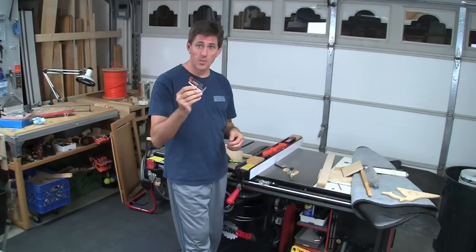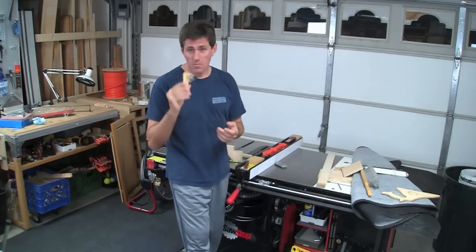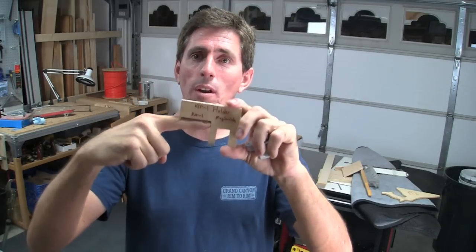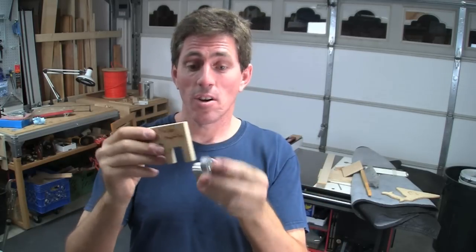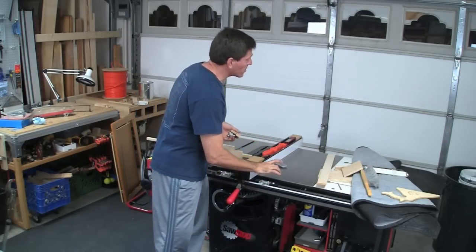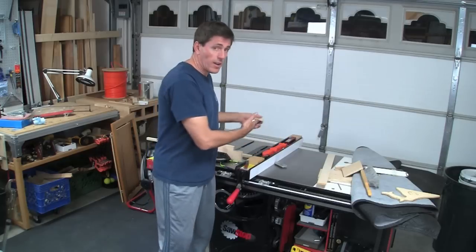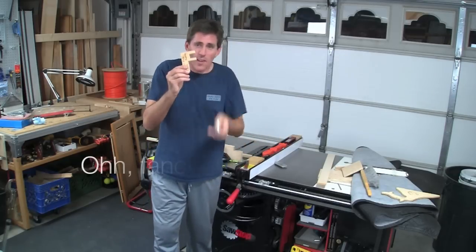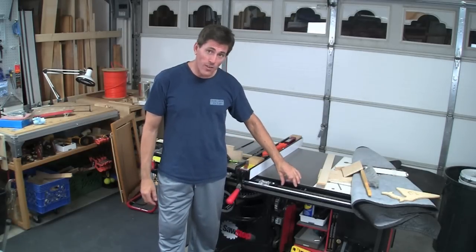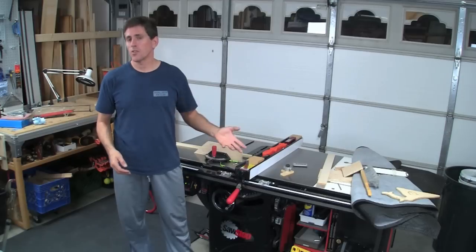When you're working with a highly precision piece of CNC aluminum that's been anodized, the best thing to do is create a little jig made out of MDF to help you out. This little jig is for my table slot — I place the KM1 here, and I cut a little tiny slot for a mag switch. This makes it easy to set a stop block wherever I want for doing my two cuts. I set the distance of the fence for one shoulder cut, flip the KM1, adjust the fence, then do the other shoulder cut. You don't need a fancy piece of MDF — I used to just put it on the fence rail and clamp the other end.